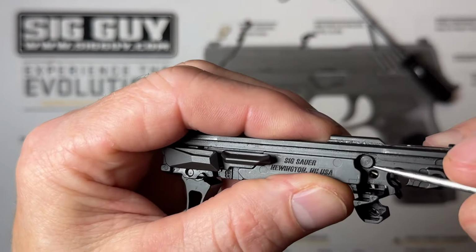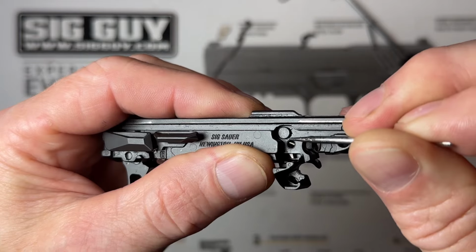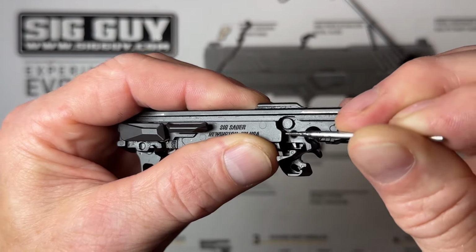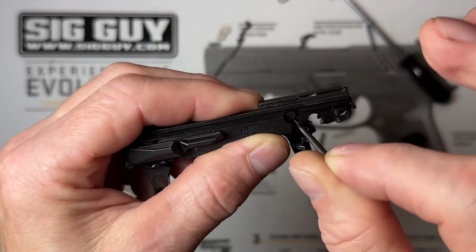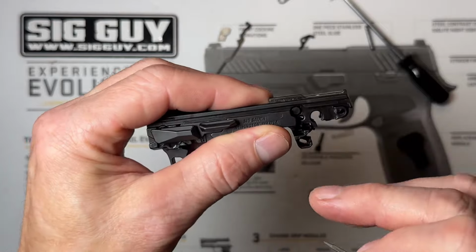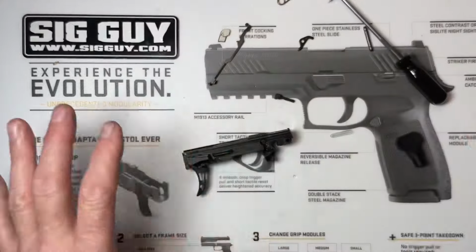When we do that, there's a little shelf or a notch above this hole on the inside of the FCU. So when we move that spring up high enough, and because that spring's on a little bit of an angle, it'll actually transfer over onto that shelf. That way, when we pull out the tool that we moved the spring up with, now there's a vacant hole there. There is no spring or wire in that hole, and we can easily reinstall our safety lever pivot pin. So that's the whole process of all this.